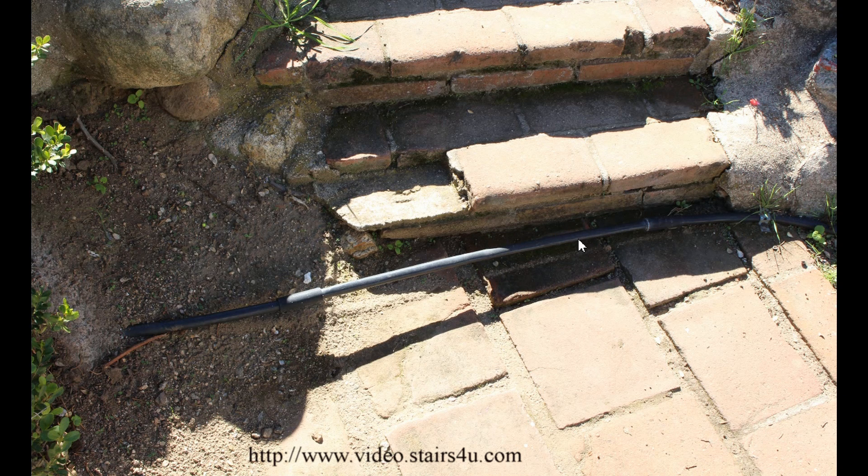I don't want to make a big deal out of this. If you need to do something like this, all you need to do is pop up these three or four pavers, maybe this area here, run the conduit underneath, and you're done. This isn't rocket science. If you have a stairway with a nosing — like a one-inch overhang — you could tuck the conduit underneath it, or shove it tight up against the base of the riser.